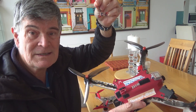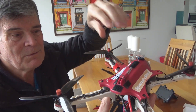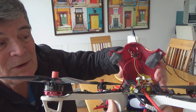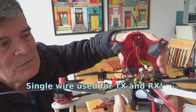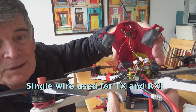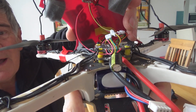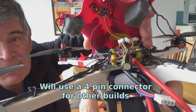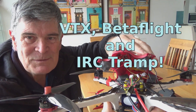What I've been doing is putting it into this large drone to do the testing. The way I've done it is similar to how I used to with the Bugs 3 — putting it in up at the top. What you might notice is a little extra red wire. I've got a three-pin plug connecting it, and then there's an extra red wire soldered directly to two points, which are transmit and receive.